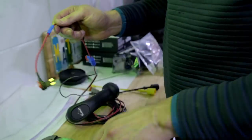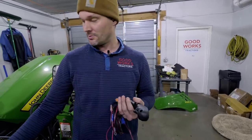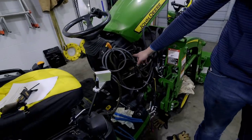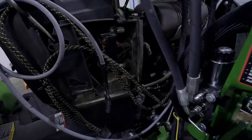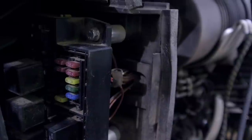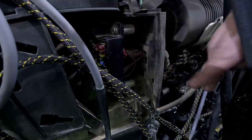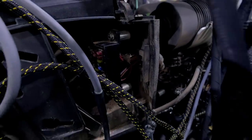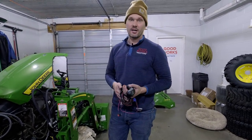That's pretty solid. In this step we are installing the joystick onto the loader joystick and connecting it to the fuse panel. I've quickly removed the side panel — you can see the fuse block right here. You want to connect to the ignition run power, which is the second from the top on mine — check your diagram in the manual or on the back of your side panel. That way the solenoid power will only be active when the key is turned on, so it won't drain the battery when the tractor is off.